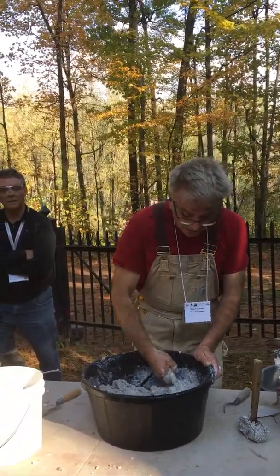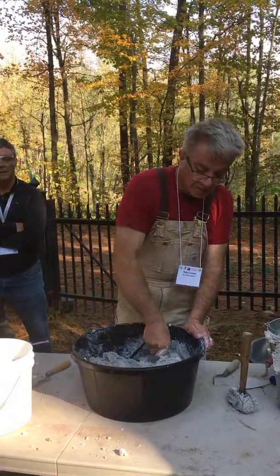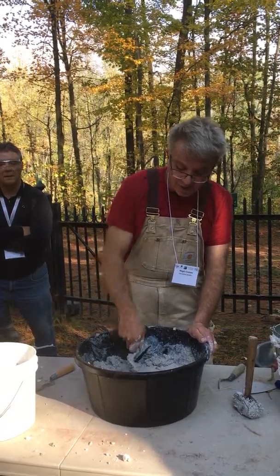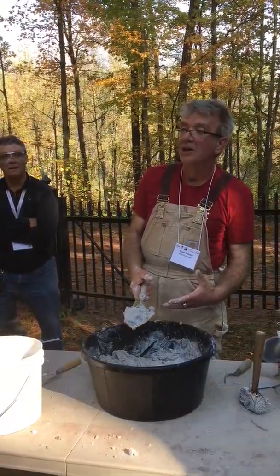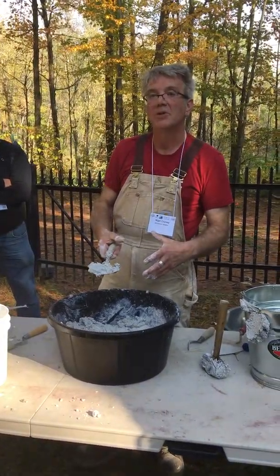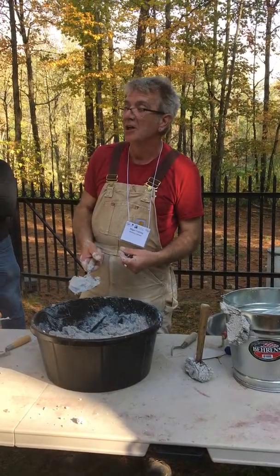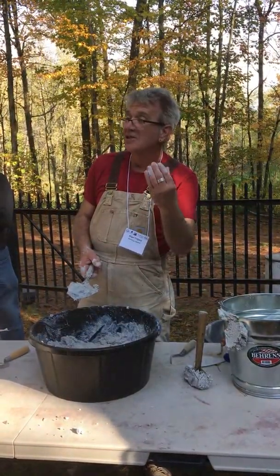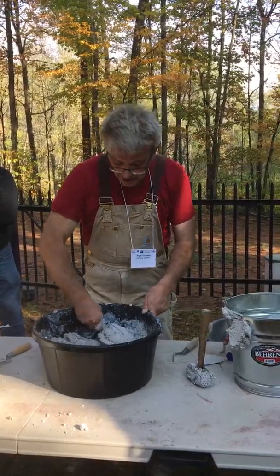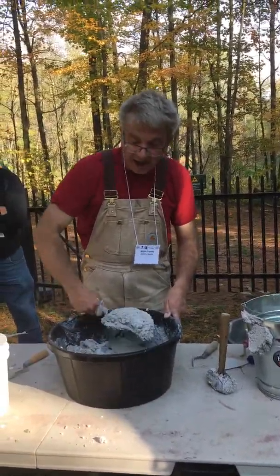So yeah, that's not far off a good bedding mortar, depending on the porosity of the stone and so on. But I'd still take it wetter than that for a plaster mortar, but of course we'd have hair in there. Again, I would tend to put the hair in at the hot stage and mix that in. Or hemp shiv, which is very common in the UK. We use that a lot as an insulator, and it reduces shrinkage, of course. It's a double benefit. So they'd all go in at the hot stage, and the hair doesn't catch fire.